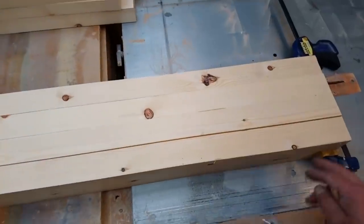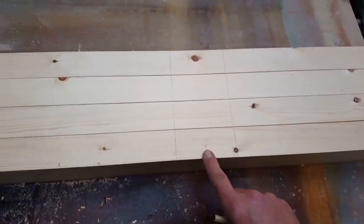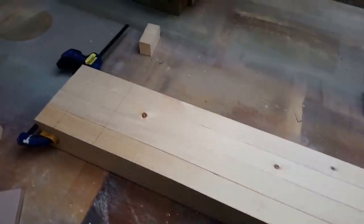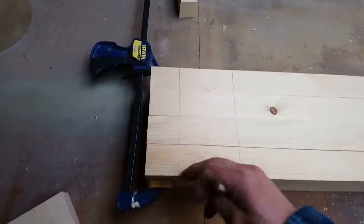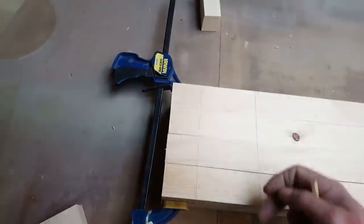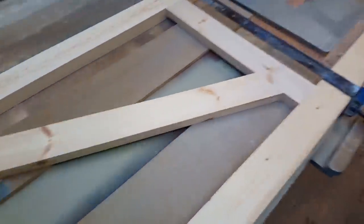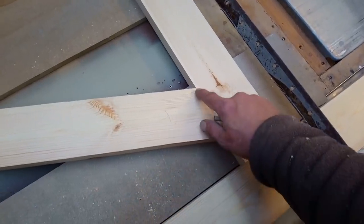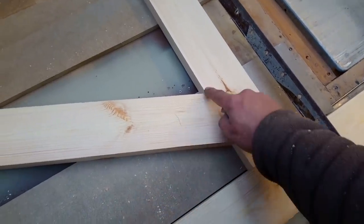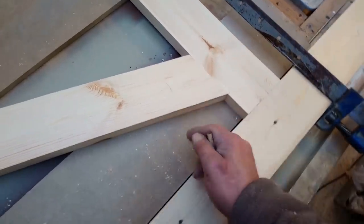Right, so I've clamped all them together. Flush at the top. That's a meter high, centre. And bottom rail, I like to leave a couple of inches up. Matchboard will fly down at the bottom. And I'm just going to put a brace in like that. I'm just going to stick a domino through. Because I'm trying to make these quick and cheap. I'm not going to house it in. Stick a domino through there.